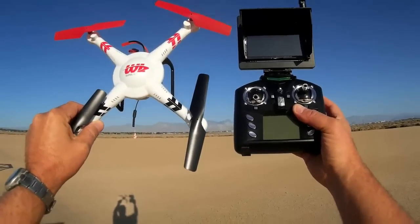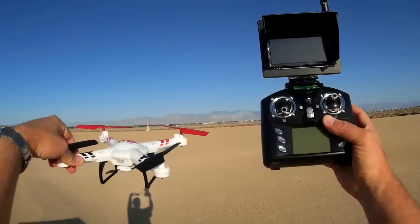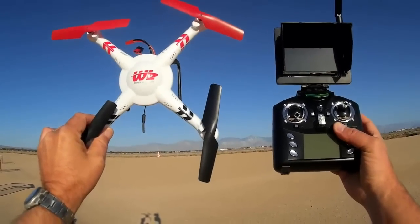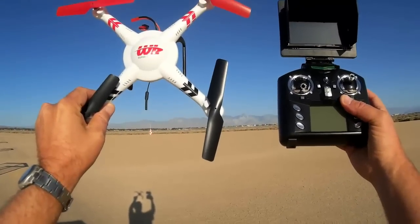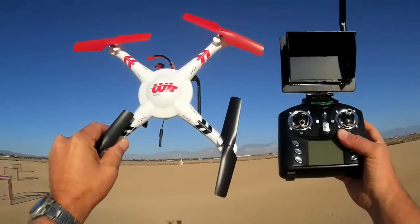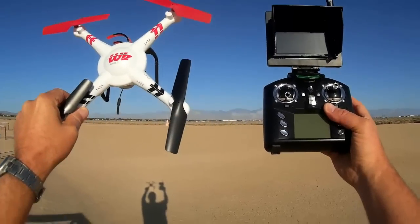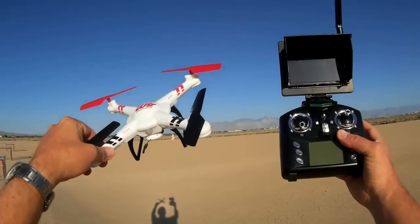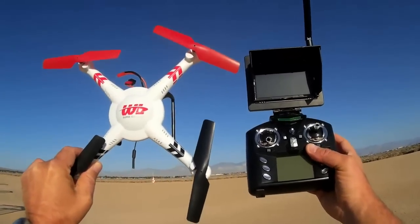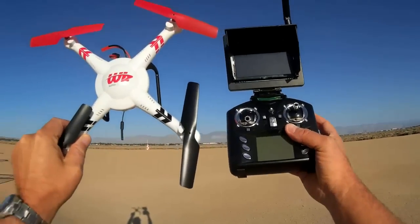There were some issues. I was noticing some wobbling. That's why I didn't publish that video yet, because I think the calibration needs to be done — for the headless mode, the x-axis and y-axis gyros need to be recalibrated. This can occur in shipping; it gets jostled around a lot. Or in a hard crash, you might need to recalibrate the gyros too. The instructions manual to show how to calibrate that are just awful as usual.